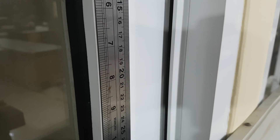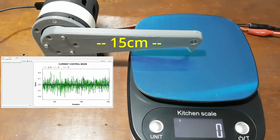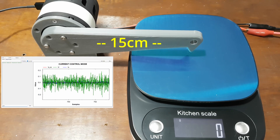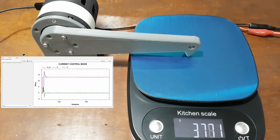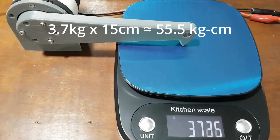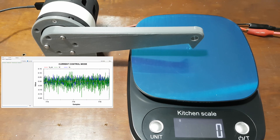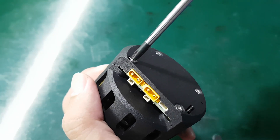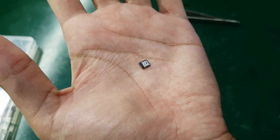This could probably be improved by adjusting the design tolerances, so I won't need to sand the parts manually next time. I attached a 15 cm lever arm to the output shaft and had the actuator press down on a scale at the end to measure how much force it can produce. The actuator was able to generate up to 55.5 kg·cm of torque. In this test, I limited the IQ current to 15 amperes, which means the maximum torque was also limited. I've actually tested it with a higher current limit before, but one of the MOSFETs ended up failing.